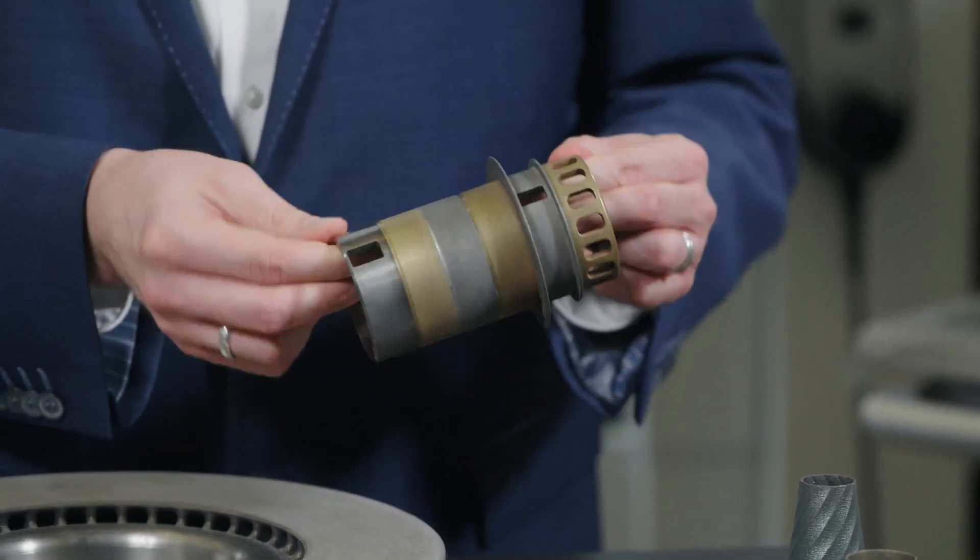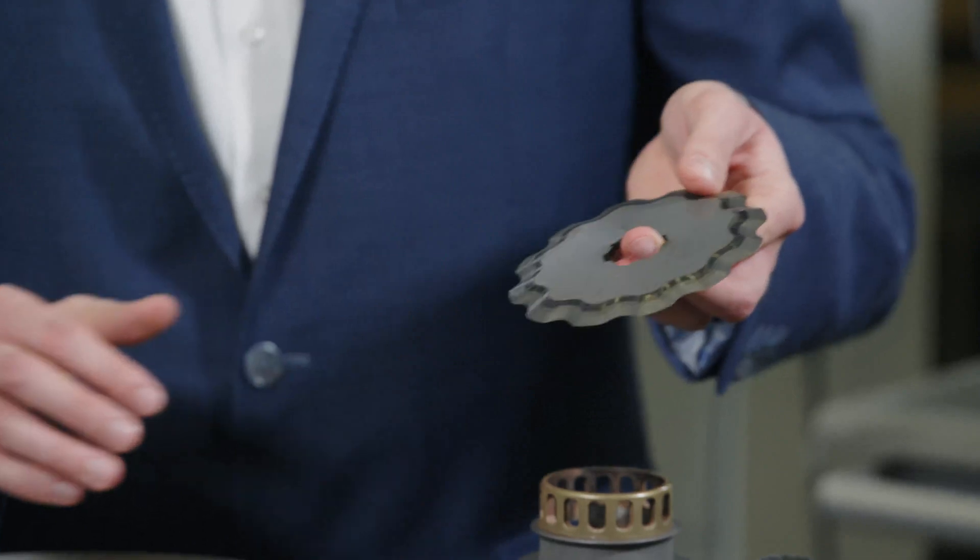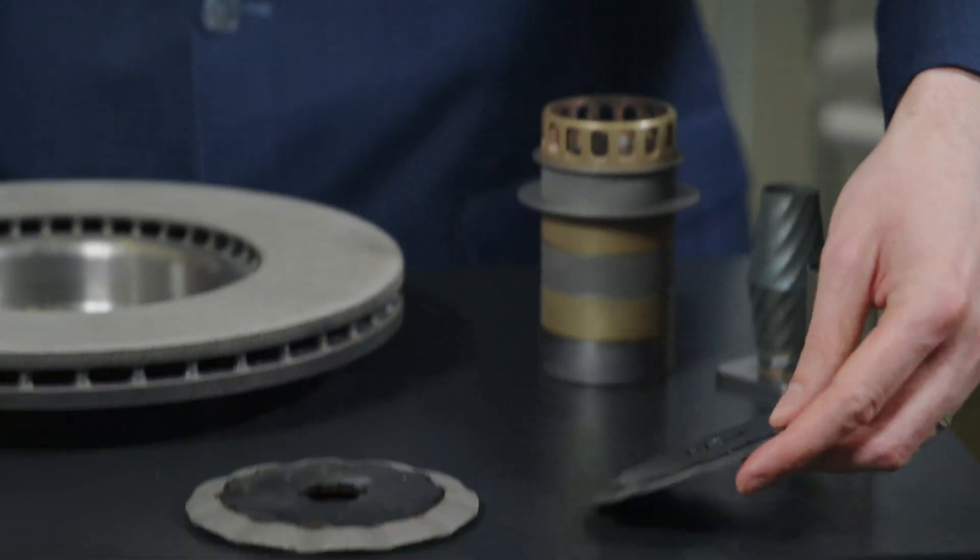Examples for such components can be found in virtually any industry — either for enhancement of corrosion and wear protection of pistons and shafts, for instance in the steel or paper industry, or to improve wear protection of digging equipment or agricultural tools by application of very hard, nearly defect-free coatings, for instance with titanium carbide.